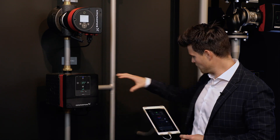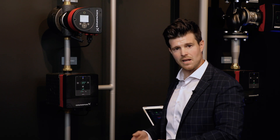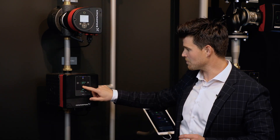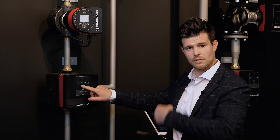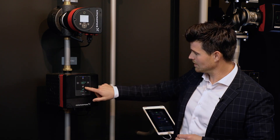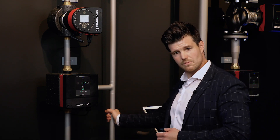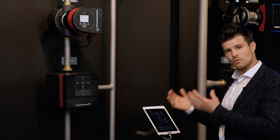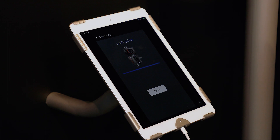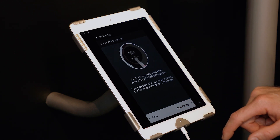Mixit doesn't have a large screen — just the essentials visible when you go down to the plant room. The display shows the actual flow-side temperature; press once to see the set point it's trying to obtain, which can come from an outdoor sensor or BMS. Press again to see supply and return temperatures indicated by color. For commissioning, you use Go Remote, which has a step-by-step wizard — like setting up a printer — asking the right questions in the right order: heating or cooling, radiator or otherwise, set point source, and so on. Simple and easy to commission.